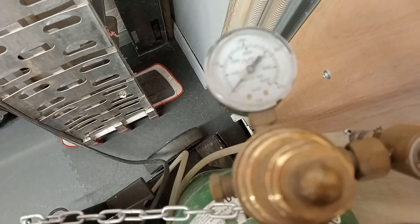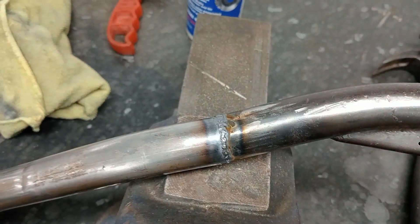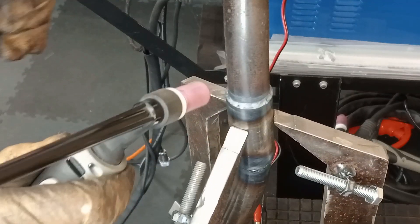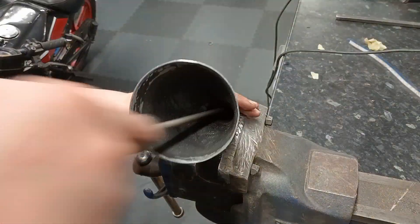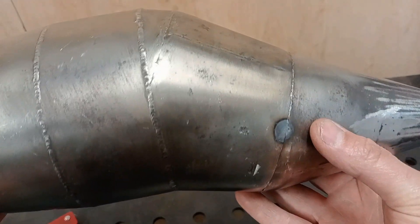I've not got a lot of argon left. I'm not happy with that, so I've got a bit more tubing and I'm going to cut a bit of this. You can see the weld penetration — it's not too bad actually. I've got a few tacks on it. The tack is not too bad; I've got really good fitment so this should weld quite easily.